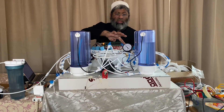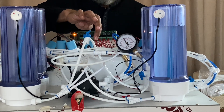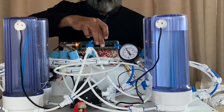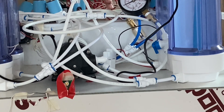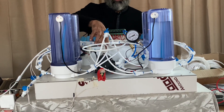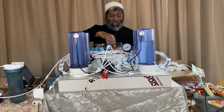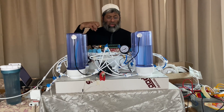This is the pressure gauge which is located at the highest pressure point, that is at the discharge of the pump. I have a pressure switch that will switch off the motor in case the pressure is high, and that is hardwired directly without going through the microcontroller.